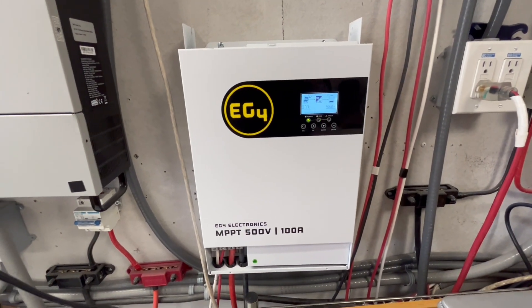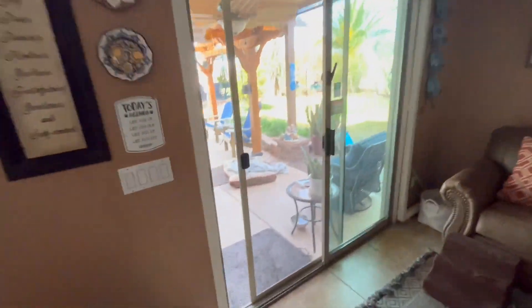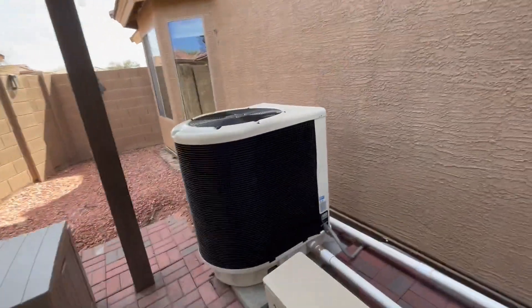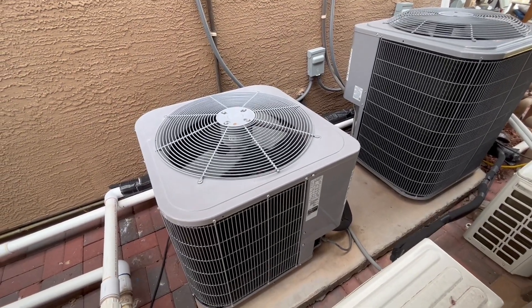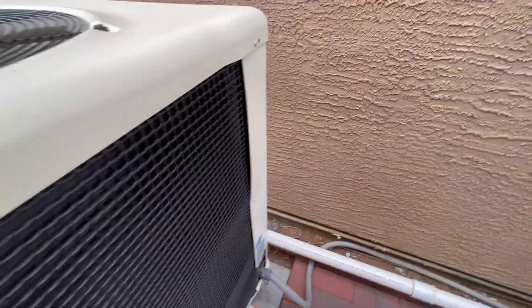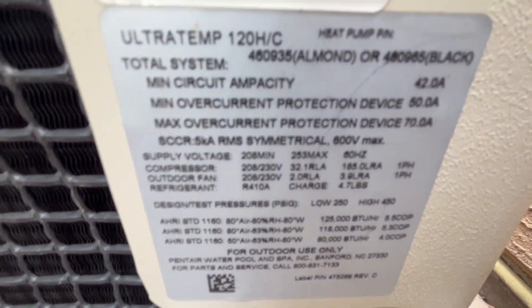That beast is running out there — it's so much power. Before I put the soft start on, it was pulling almost 180 amps inrush on each leg of the 240 — so each 120 volt leg was showing close to 180 amps inrush when I started it up. This three-and-a-half ton was right around 76 amps inrush before I put the soft start on, and that dropped it down to about 18 to 22 amps inrush. For this one, I put the soft start on and dropped it down to about 40 to 59 amps inrush.